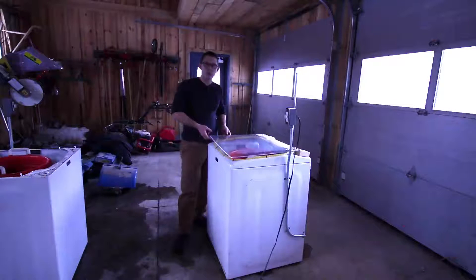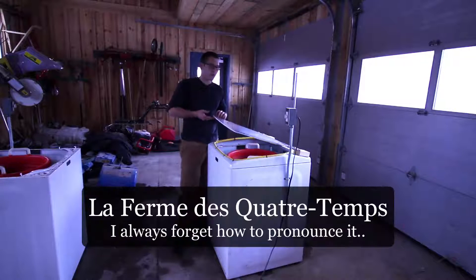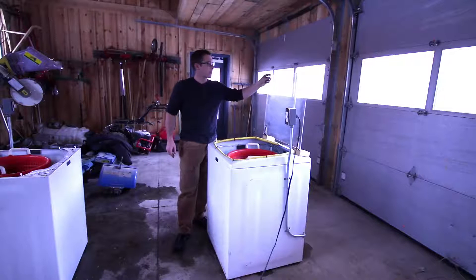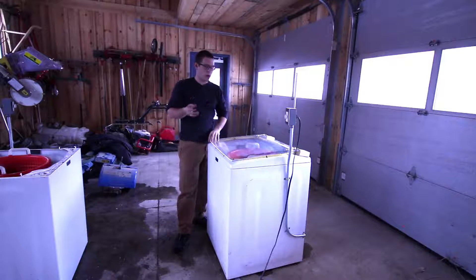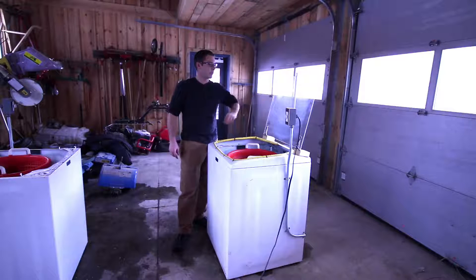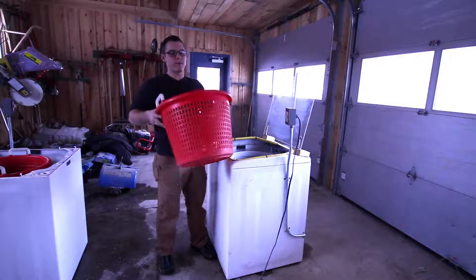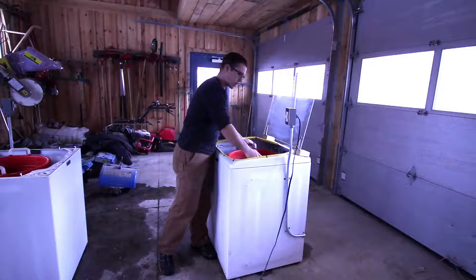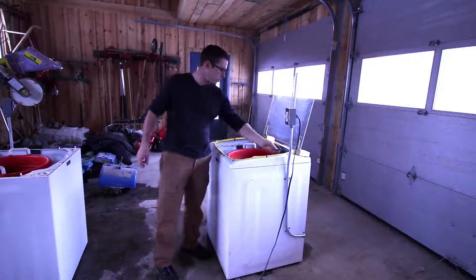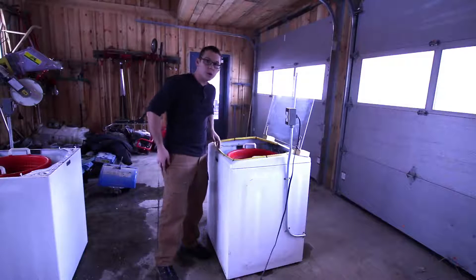This is the latest washer conversion we've done for the Four Seasons Farm up here in Quebec. I want to show you a couple of new features. It has a plexiglass lid to protect the operator from hands getting into the basket while it's spinning. We're using orange baskets in here — you can buy four, five, or six and they just drop right in. It has a regular timer, and we cut the top a little bit wider and put hose on it.